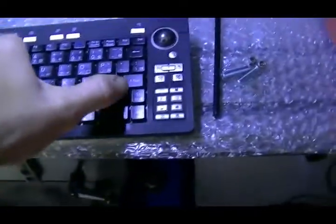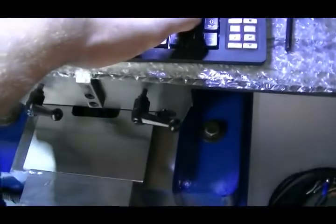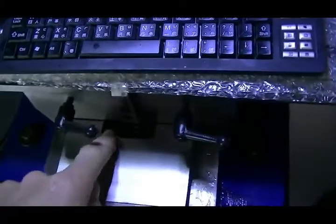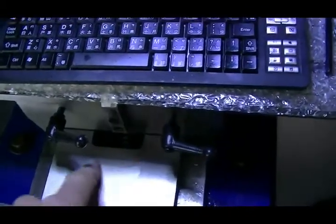One thing I have done — I will just move the table back a bit — I took 25mm out of the front of the table here to allow a little bit more Y axis travel forward. I didn't modify the back at all, I left the back standard. I took a little bit more out of the bottom of the Z axis column to allow a little bit more down travel on the Z axis. I did also neaten the Z axis column up with a grinder because it was rough as guts.